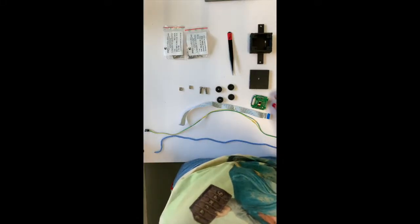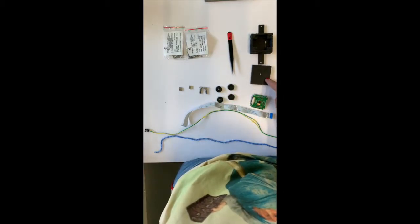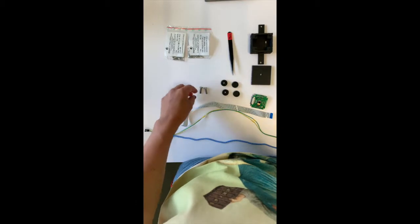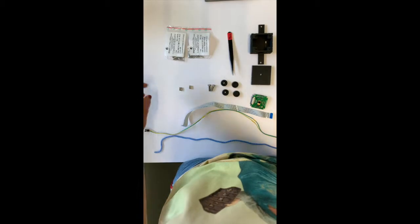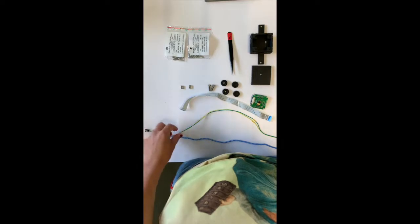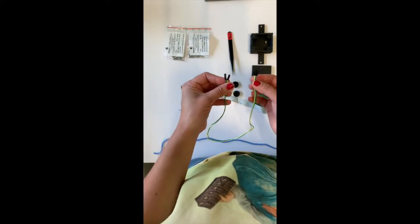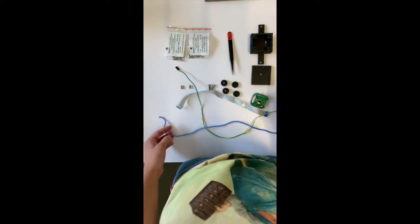To mount the ArduCam camera with a motorized focus, you will need the camera by itself, camera house, a lid for it, M2 25mm screws and hexagonal nuts for it, 2 caps and 2 bottoms for screw thumbs, and 2 bolts with hexagonal head, 2 M5 T-nuts, a flex cable for the camera, 2 jumper cables that are approximately 50 or 60 centimeters long with female connectors on both ends, and a spiral cover for it, and a pair of tweezers.